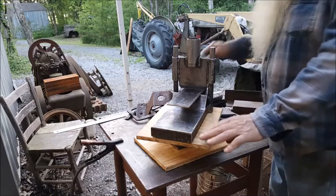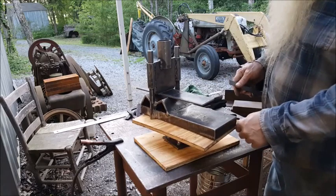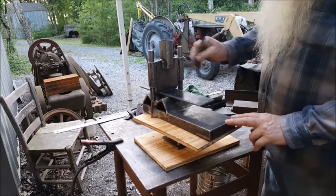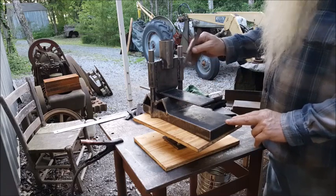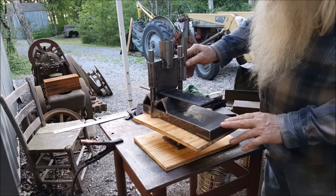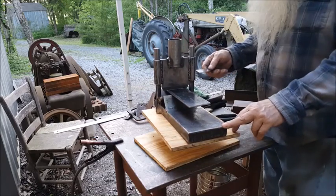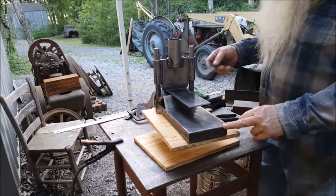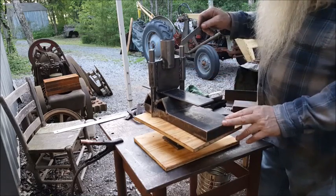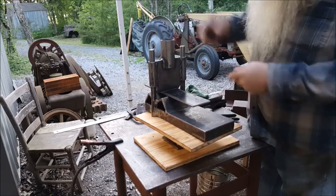Well, you know the other measurements on this, it's a die. It's two parts. I think there's two different names for this. But the uprights right here, they're 3.5 inches long. Them two pieces of pipe right there, that's that 3/4 inch handrail pipe, bright pipe. And this here is a sliding fit inside of that. It works as a guide.